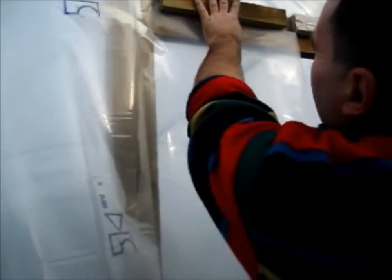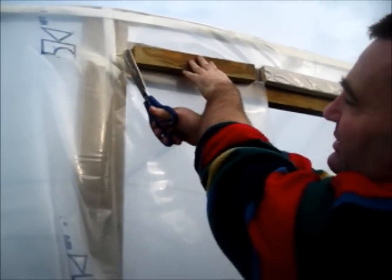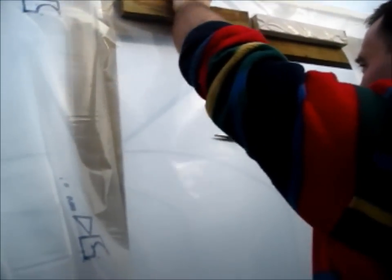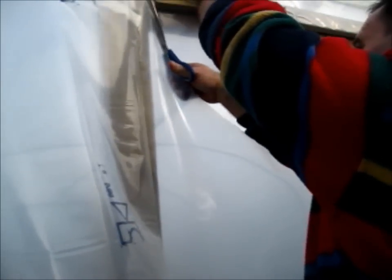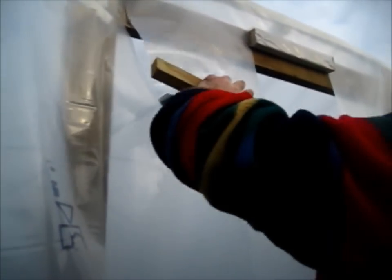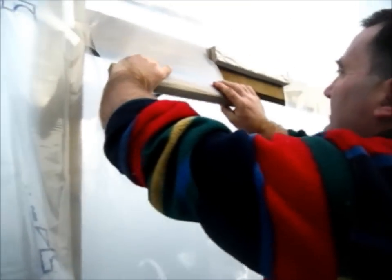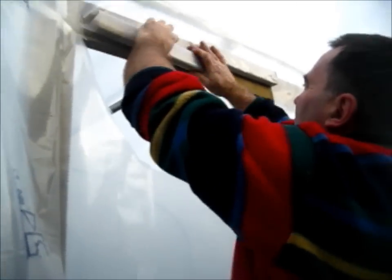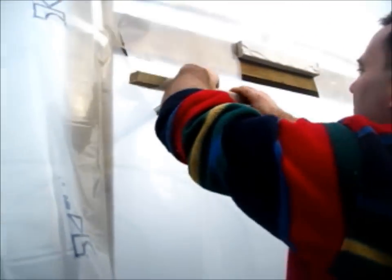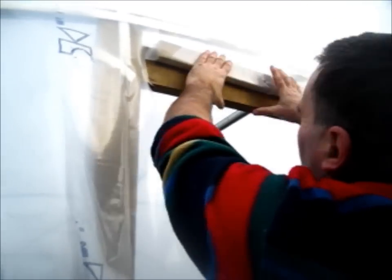When you're driving the screws, don't drive them all the way through — just drive them flush because they'll be coming out again. The next timber then goes here; because this is sloping down slightly, we'll have to slope this up slightly when we're twisting it. We want to come across here to about here, then come up at a 45 degree angle, and then up here. You want to get the same amount of tension as the first one, so you have to fold it until it basically falls into place.